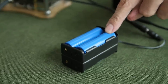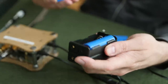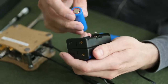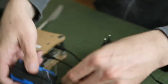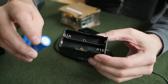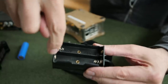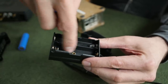So we have a single battery pack for the clean side and a switch-mode brick for the dirty side. You have to be very, very careful with this battery pack and put the batteries in the right way, otherwise you're going to end up with a small fire — as we just had here. We had to stop filming. The signage says plus towards the nodule and minus towards the spring, but on the other side the orientation changes, and if you follow the wrong side, the pack literally lights up with a flame.